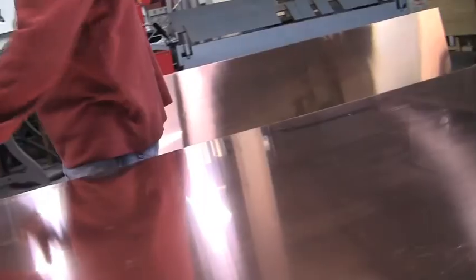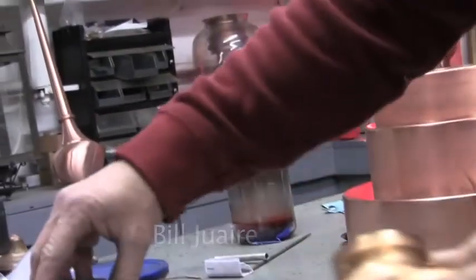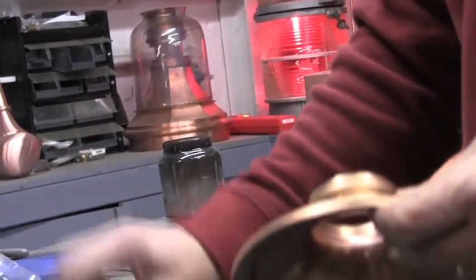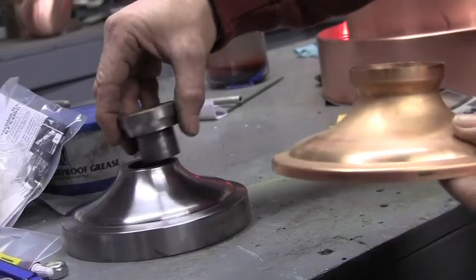For this to cut circles — whatever shape I'm going to spin — I need a form that kind of mimics it to get the shape. I have to have the exact same shape to spin on. We make these. This is a steel chuck.